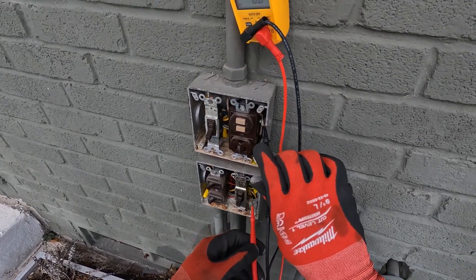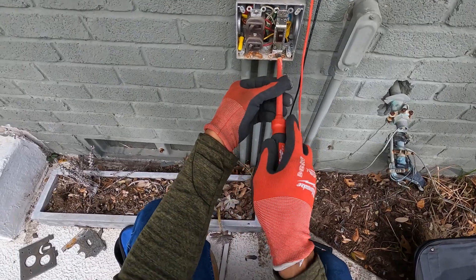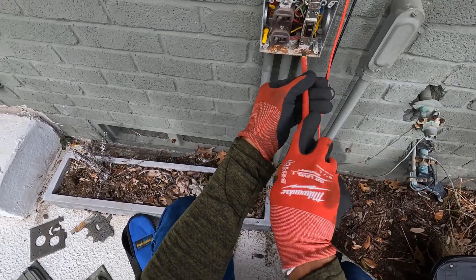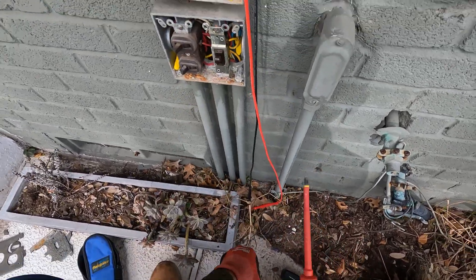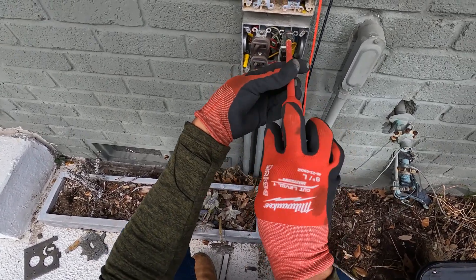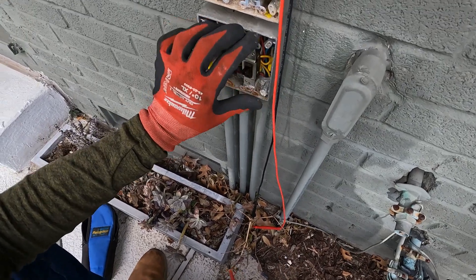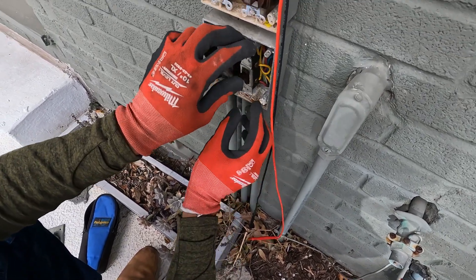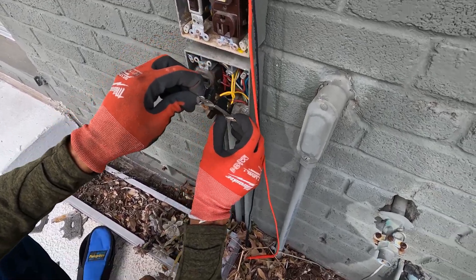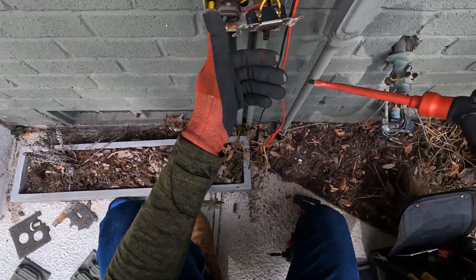My power is on the hot, so we're going to switch that up. I'm not certain what this switch goes to, but I know how it's wired — it's backwards. If they're trying to get power to the switch or to the other wire, it's not going to work like that. I'm going to switch these two wires.